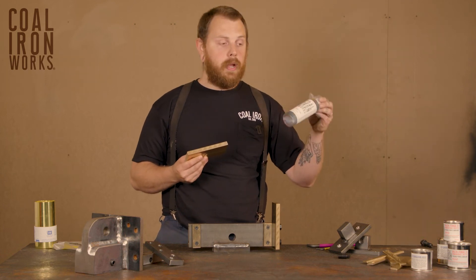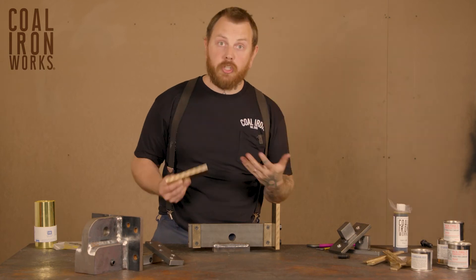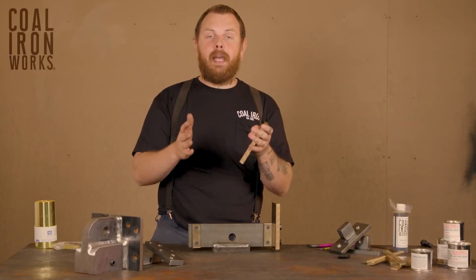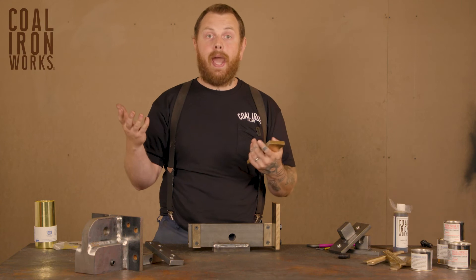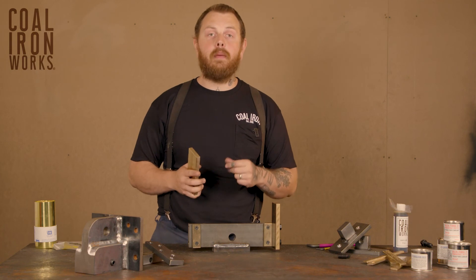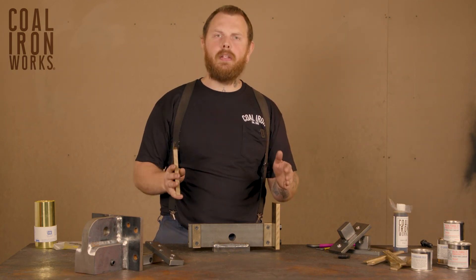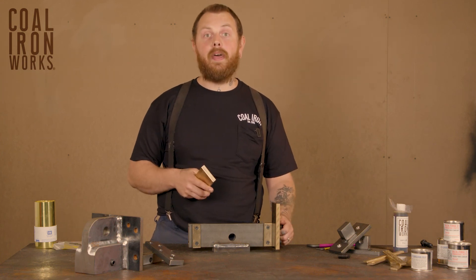You want to be using way lube. Another caveat: if you apply too much lubricant, you're going to get a really weird response as it moves up and down. What you want to do is run your slide to the top, take a rag, wipe away any excess oil, reapply fresh, and then run it up and down a couple more times. Generally it's too much oil that'll cause some vibration and some odd response from the bronze. So that's a good way to deal with that problem.